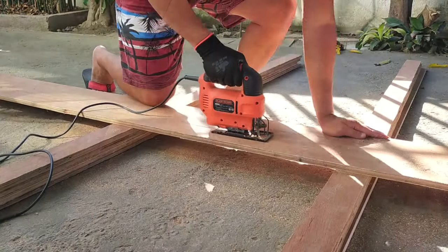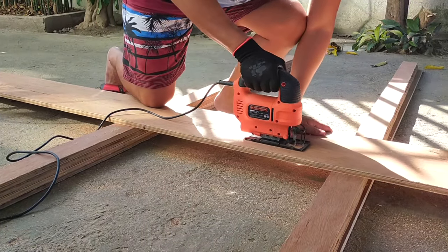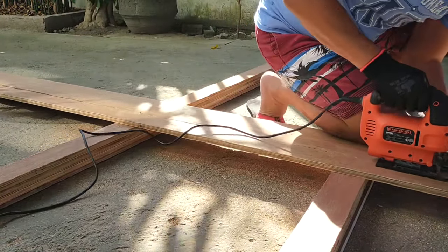Going back, I chose three-quarter inch thick because from my experience it is the optimal thickness for building strong shelves and cabinetry. Anything thinner would simply be too flimsy to hold heavy items, even to hold their own weight.